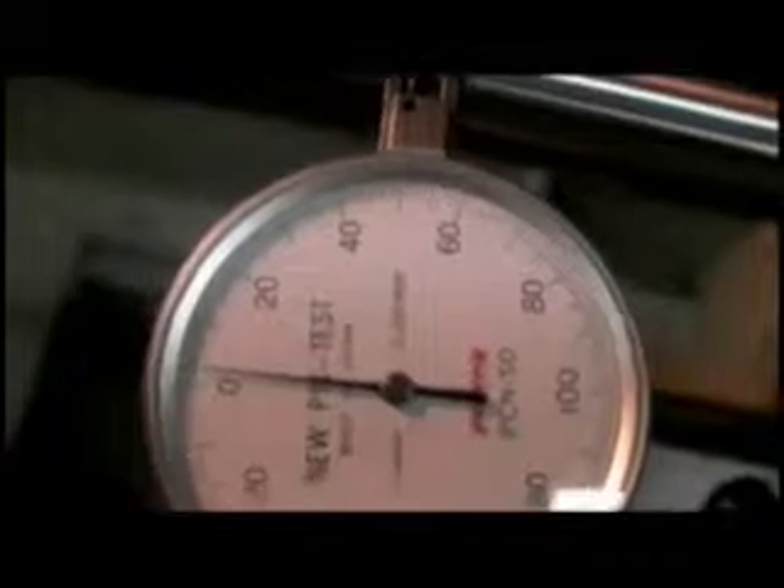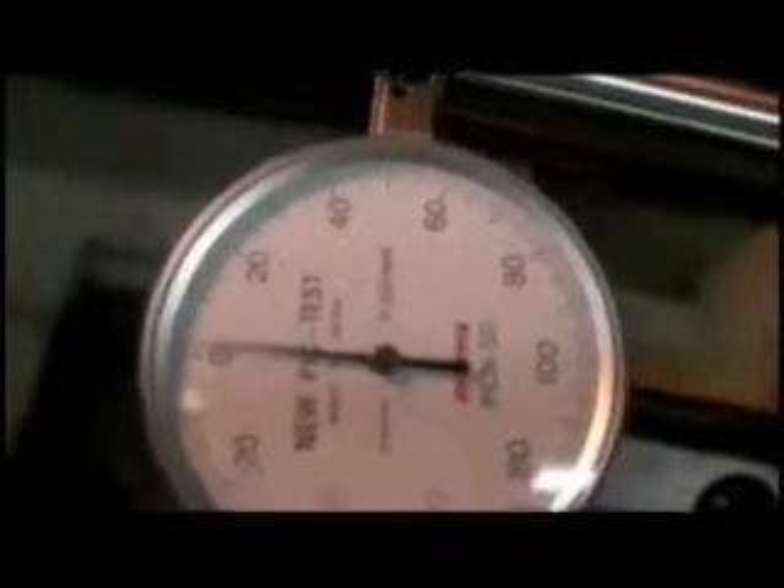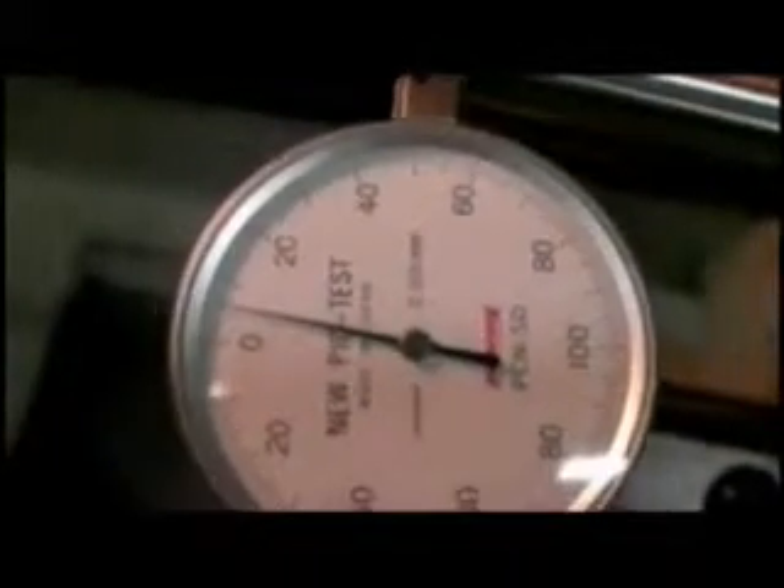Fourth, high accuracy — our multi-jaw compensating chuck allows clamping of various workpieces having up to 50 mm diameter difference without preset. Fifth, no need for a rotation cylinder. Power sources such as hydraulic unions or rotary joints are not required. Sixth, design ensures fewer tension of clamping even at high-speed rotation.